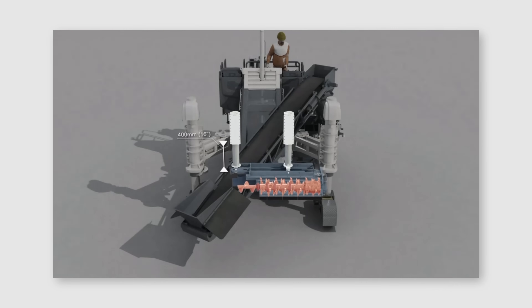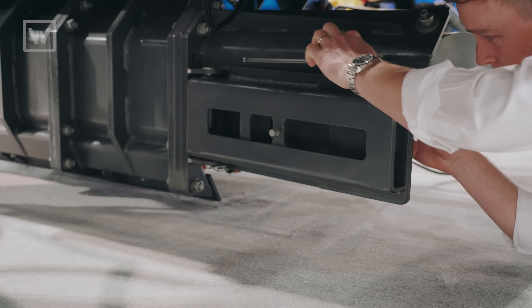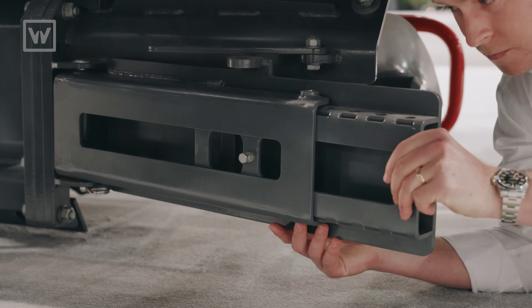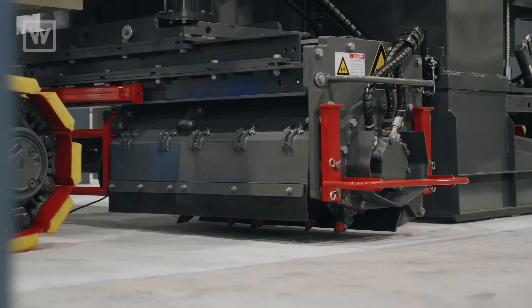The trimmer has 16 inches of cylinder stroke — left cylinder and right cylinder. If that's not enough, you can also lower the mounting holes on each cylinder to give you even more depth. The trimmer also has a windrow door mounted on the right or left side depending on whether it's a left-handed or right-handed trimmer. The door has an extension so you can move that windrow further left or right, and the swinging door can also limit the amount of volume and how high it stacks up.